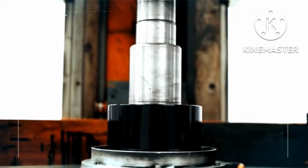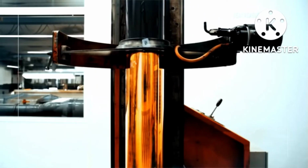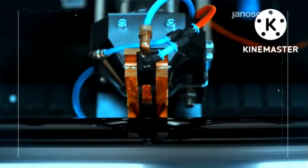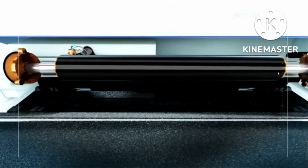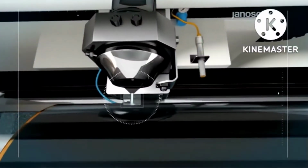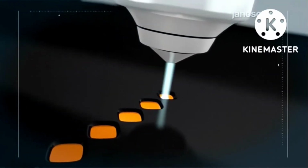Before starting the laser process, an etching resist is coated onto the whole copper cylinder. This layer protects the cylinder against the ferric chloride during the etching. Its thickness may vary from 3 microns to 5 microns, depending on the requested etching depth. The laser process reproduces the design onto the etching resist by removing it. The copper remains unaffected by this production step.